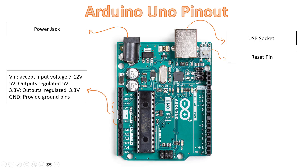Here we have some pins associated with powering, like the VIN pin, which is for powering the Arduino board using this female pin — you can input 7 to 12 volts here. Then it has a 5-volt output pin and a 3.3-volt output pin. These are regulated output pins from which you can power up your external circuits. We also have ground pins — two ground pins here and another ground pin on the right-hand side in the top portion of the rail. In external circuits you may need multiple ground connections, and you can use any of these.